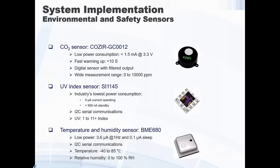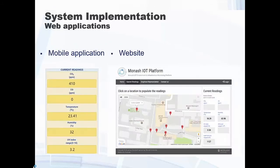For the wearable nodes, these are the commercial sensors we use. We focus mainly on low power and low sleep-mode operation — when things are in sleeping mode, the leakage power should be as low as possible. Because if you are indoors, the energy harvested is quite low, and we want to make sure we are earning from the energy harvesting.